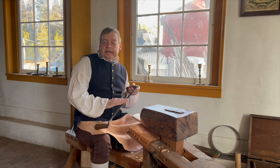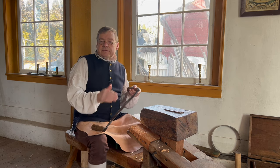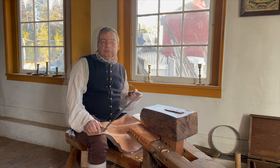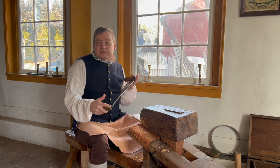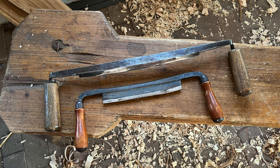The backing knife has a flat, narrow blade with a slightly convex cutting edge and is typically 14 to 16 inches long. The backing knife differs from its cousin the common or American pattern draw knife in that it is wider, it has no flute, and its back is flat rather than saddleback. All examples of the backing knife that I've seen lack the metal ferrules that we see on the American pattern draw knife.